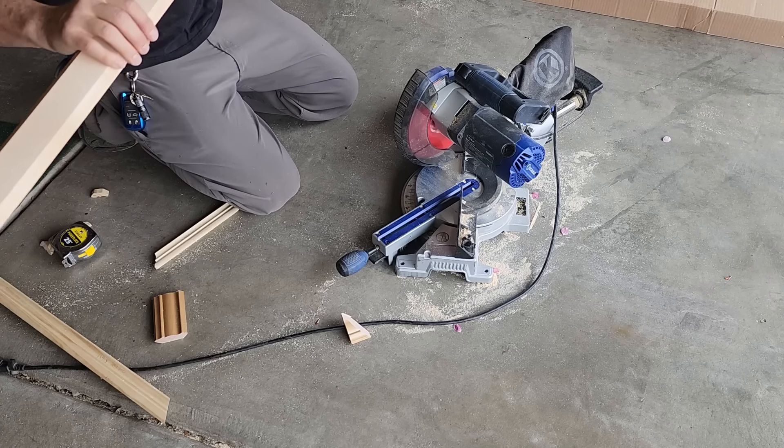Get all my pencil marks off and we're done. You might be wondering — what about nail holes? All cabinets should come with a fill stick. This is basically wax and you just rub it on there and wipe the excess off. These are very, very tiny holes — most people wouldn't see them. But going around and coloring it in with this fill stick: if you've got a bad joint, there might be a little bit of a shadow you're not happy with — you hit it with the fill stick. And if it's the right color, it just disappears. You can also use a screwdriver to round over the edge if you've got a tiny little gap.